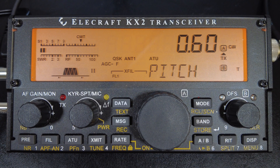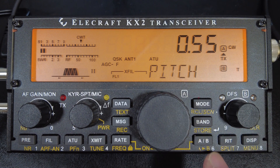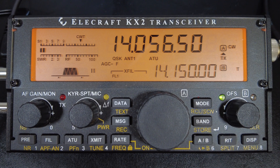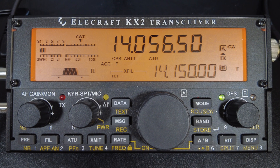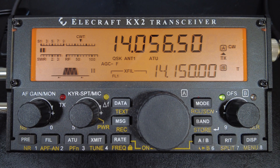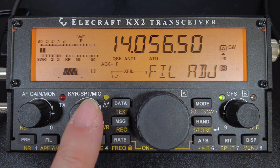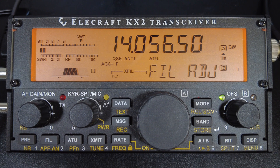To change your CW pitch, rotate the VFO knob — it changes in 10 Hz frequency steps and will emit a tone at that frequency. I'm going to leave mine at 550 Hz. After changing the pitch, you'll also want to adjust your center frequency — another CW only setting. You want to center your passband around your CW pitch so it's not skewed to one side. Just tap the FIL button, then press in the key/speed knob, and it will automatically center to your CW pitch.